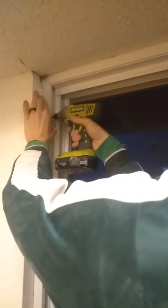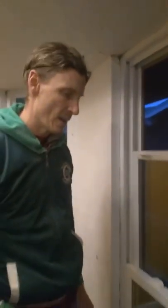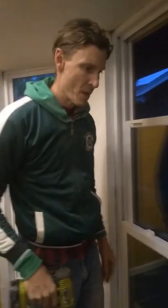So I've been screwing it in. I might kind of move this window around — I don't know if these screws are final but I'm going to get four screws to hold it in there. It hasn't been perfect before I put that last piece of the steel window wrap on the bottom. I'll probably put window wrap around the sides after, but these remodel windows are a little bit different. The main thing is sealing it with foam and caulking, and the window wrap around the sides is done a little differently.